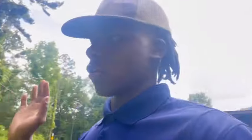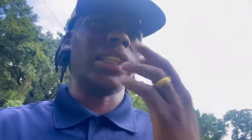We got another call. This call is walk-in freezer fans are not running. So I just walked in this motor room. The compressors and all that are running. We got about 5% or so. I should have looked at my sight glass before I recorded, but I need to check my sight glass. I'm pretty sure it's clear, but we got like 5% of liquid.